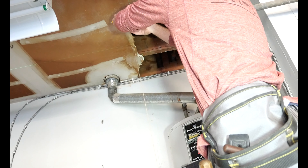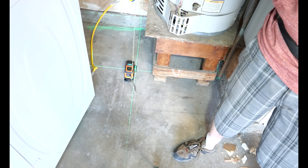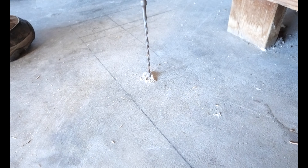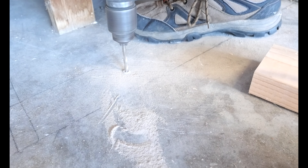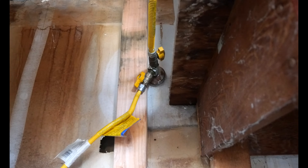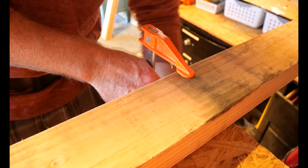For this project we needed to create some type of structural frame to attach the pallet wood slats to. So I just used some 2x4s, found the studs on two sides, and then for that third corner piece I mounted it to the two floor pieces and two ceiling pieces — it was pretty sturdy. There were some spots where I actually had to mark out and notch out of the frame some slots for electrical and gas and a few other pipes.